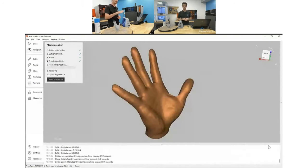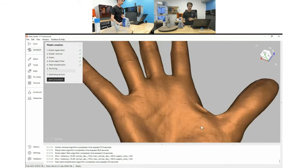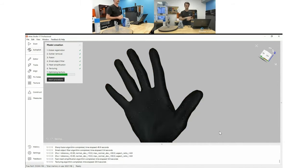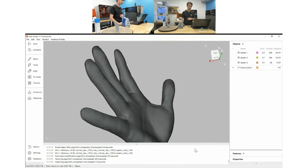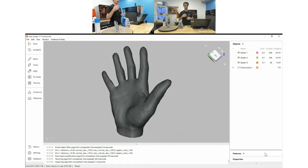Texturing is actually one of the cool parts of Artec — even though it's a blue light scanner it still gives you full color. You can see this is basically your final model, you can see all the layer lines in it. The texturing puts the gray back on. If you have features where you find a need for color information — either for reference or especially in the movie industry for CGI — texturing can be a very powerful tool. So we got that color information right back and you can see all the different layer lines.